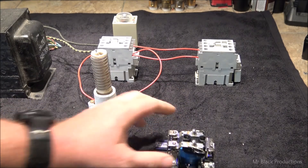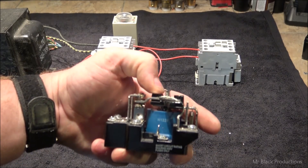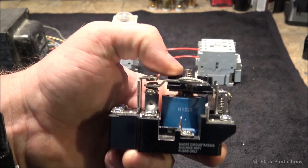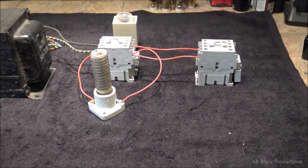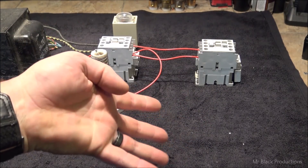I'm putting this in there so everybody can understand their circuit and their amplifier from beginning all the way down to end. Contactors come in many shapes and forms. A contactor is nothing but an overcharged relay. You're going to have a couple of points that sit in an open and closed state with a coil that moves the conductor point — like the points in our old cars. These are Allen Bradley, 110-volt coiled, and they've got four positions on them — so it's a four-pole contactor. It can flip on and flip off four contact points.